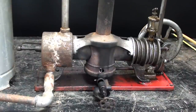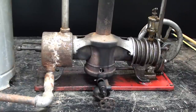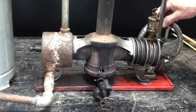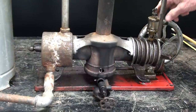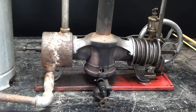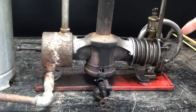The operator of the engine would be well advised to lubricate the slide rod here for the displacer as well. Now this engine is really double-acting — that is, pressure will push the piston out, and then according to the Stirling engine cycle, a vacuum is formed and the piston is sucked or pulled back. And that's happening rapidly, from pressure to vacuum, back and forth.